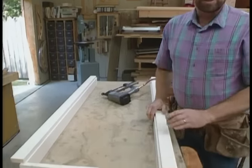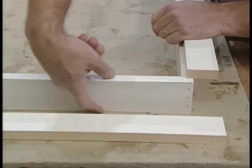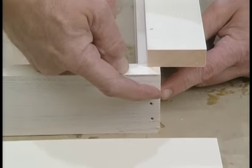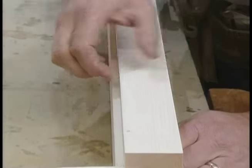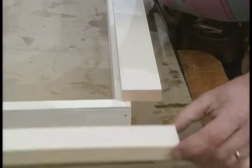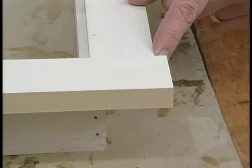The door frame and jamb is made from a piece of 1x6. First, I ripped a strip 2¾ inches wide for the jamb and connected it with a butt joint at the corner. The exterior casings are 2 inches wide, and I reveal them back about 1/4 inch. The head casing is also 2 inches wide, and I'm going to let the ends stick by 3/8 on each end.